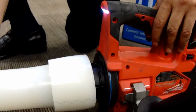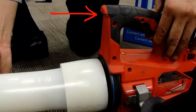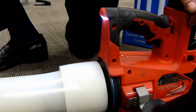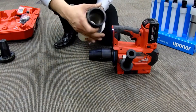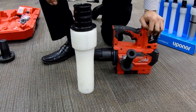Here's a close side view. See how the Uponor is inching closer to the tool with each cycle? Now we are against the shoulder of the tool. Again, when the LED light flashes, we can release the trigger. Quickly connect the fitting. Notice we do not get completely against the shoulder of the Uponor like on smaller diameters.